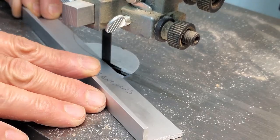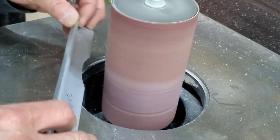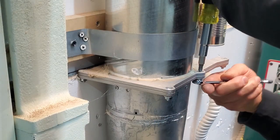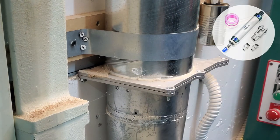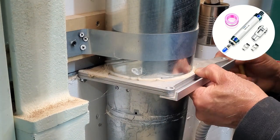I'm posting this video in case anybody's interested in seeing the shop-made automatic blast gates I made for my system and how I built them. I'll show the entire build for a gate that's automatically controlled by a single-phase 110-volt machine. I started by purchasing a pneumatic cylinder with a 100-millimeter stroke to operate this 4-inch blast gate.